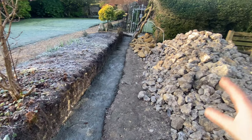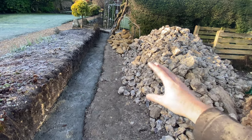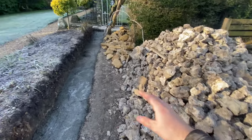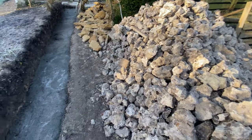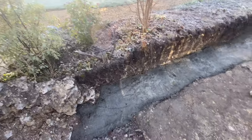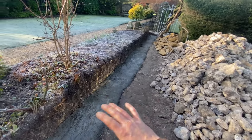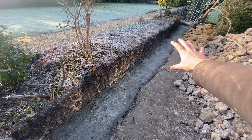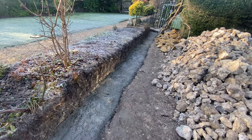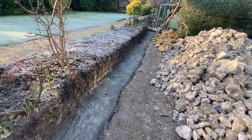So that's what we're going to sort out today. We're going to be building it in the forest marble — just rough stone basically. There's some big bits of flint, a bit of a mix of stone within the flint. We'll keep all the lovely little bits of flint — obviously one side for the tops and the build pointing. There are some big mac daddies in here, so we'll mix up the stone. We are going to point it as well, so once pointed it will probably blend all the stone together. Basically get this bottom bit sort of flat.